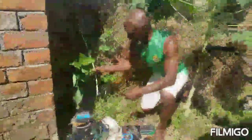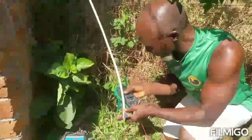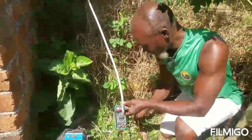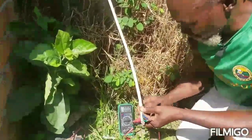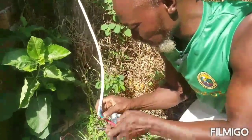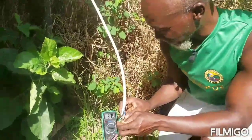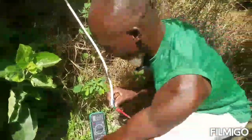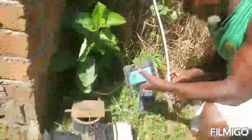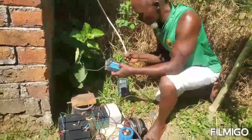This is the output terminal of that solar panel — let's see what it is doing. I put my multimeter on; this is the 200 range. Positive to positive and negative to negative. I can see it gives us 34 volts today. So I'm going to connect it to this solar charger and see if I can use it to keep this 24-volt battery charged.